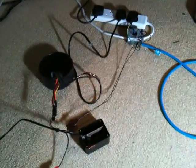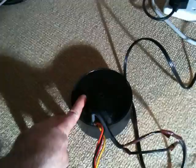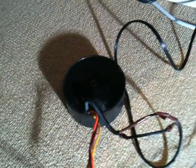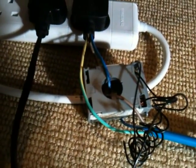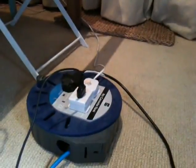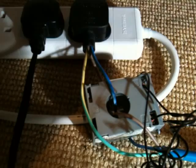This is the device. Perhaps not much to look at, but there are three main components here. The first is this — the 225VA 18V encapsulated toroidal transformer that we saw in the last video. We have this device, which is a 100A current transformer, and I've spliced it into this extension lead. The live and neutral wires are passing through the core.